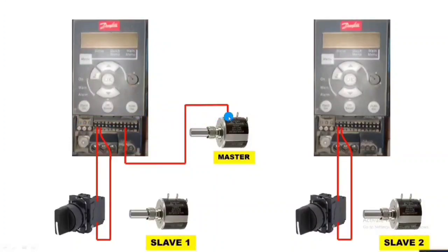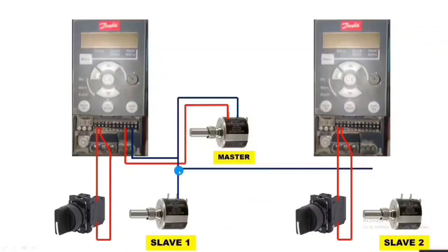Now the plus supply is connected to the master port. We need to connect 0 volts — terminal 55 is for 0 volts — so we connect terminal 55 to the potentiometer. Master port input connection is now done. You need to connect 10 volts and 0 volts from any one of the drives. We connect the master port input supply. Now we need to give 0 volt to both slave ports and also to the second drive. We connect 0 volt to slave first port and also connect to terminal 55 of the second drive for 0 volt. Our 0 volt connection is now done — we have connected 0 volt to both slave ports and the second drive.